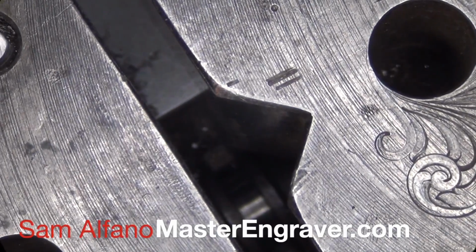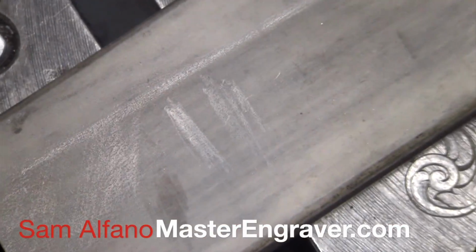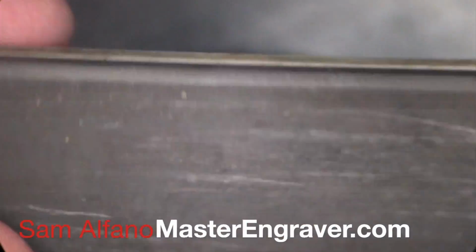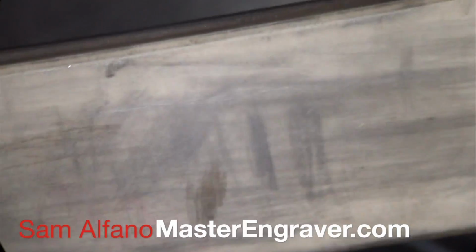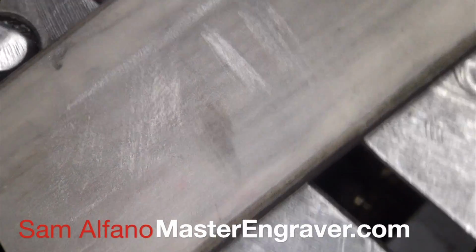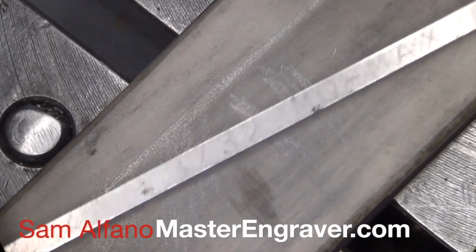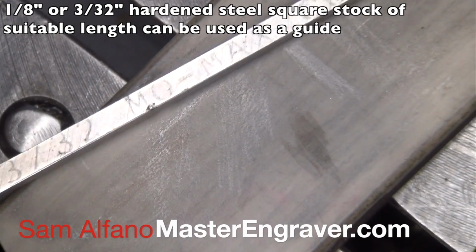So let's do the heel now. For the heel, I'll use a white ceramic stone. This was actually a sample I picked up at a gun show, I don't know, probably 25 years ago. And it's got brown ceramic on one side, which is a coarse, and it's got white ceramic on the other side, which is fine. So I'll use the fine side and a piece of 3/32 inch Momax Cobalt, and I used to buy these from Brownells. I used to make my gravers out of these years ago.